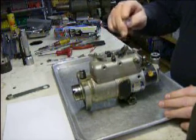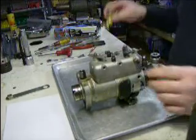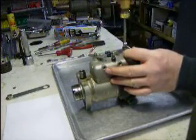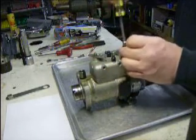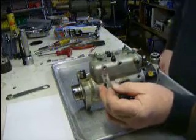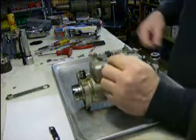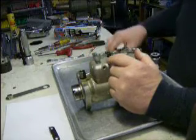You're going to take the nut off of this lever in order to push the shaft on down through it, because it's connected to a spring on the inside. It's easiest just to take the lever off. It's elongated. It'll only go on one way. The kill shaft, we'll do after we get it out.